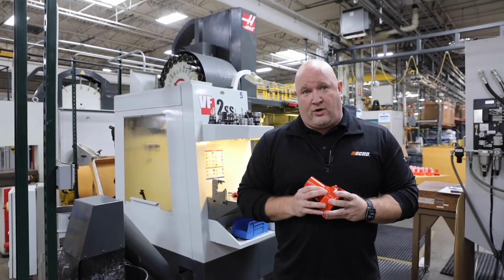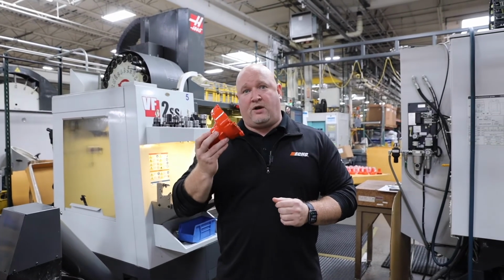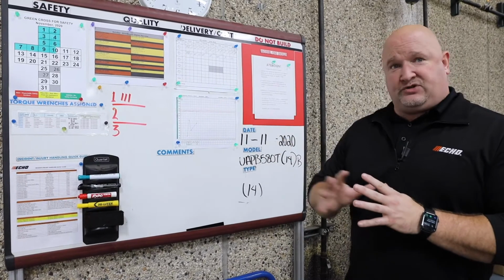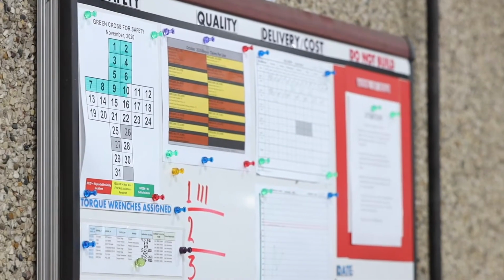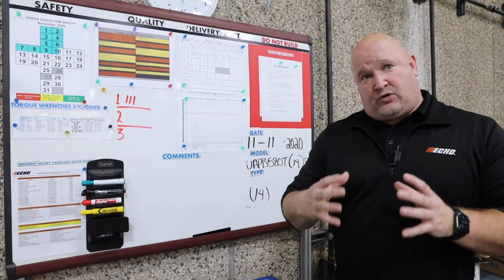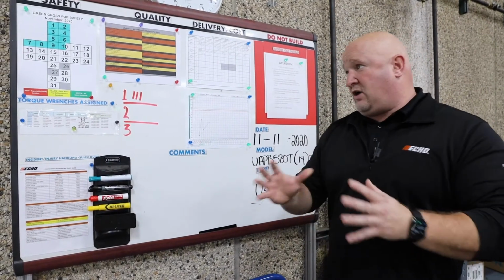After 9 months of working through it, we're able to actually have a 32% improvement in efficiency and a 30% improvement in the tolerance bands to make sure that we're actually machining a more capable and more reliable part on a piece-by-piece basis. We meet with the operators every single day at all these visual boards. And just for consistency's sake, we have safety, quality, delivery, and cost all right in front of everyone so they know safety is one, quality is 1A. And it's really important that we have this at every line because a group leader every day will spend time reviewing this board with all of their operators and talk about any issues that happened from the day before, from the shift before, so we're all on the same page.